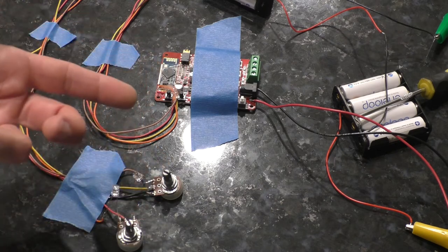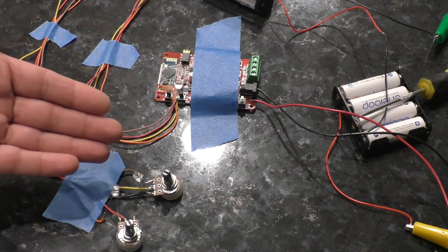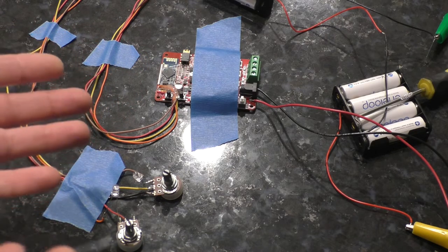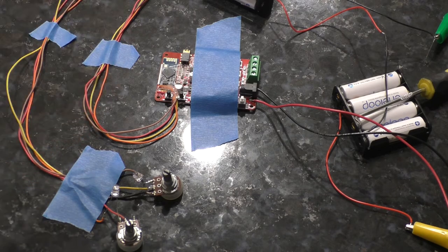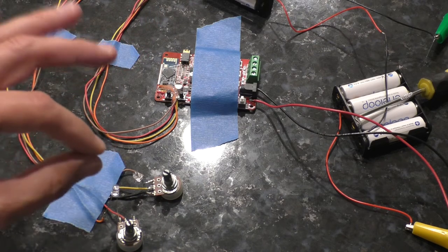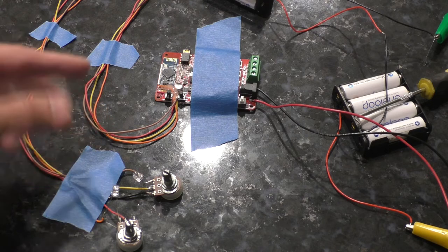to add some resistance. I always like to use as much resistance as possible to get the light output that I'm interested in, because a lot of times you can almost use double the resistance that's called for, but you won't really see any difference in the light output. So I like to do that because it'll handle any voltage changes that may happen, and also it just increases the life of the LEDs. And in this case, I kind of want a low glow anyway, so if they put out a little less light, that would be just fine with me.